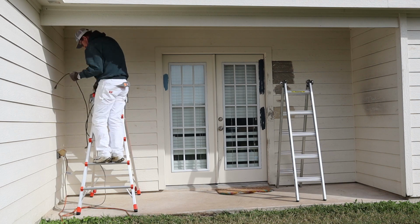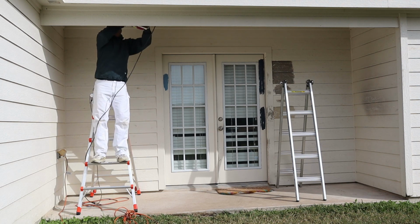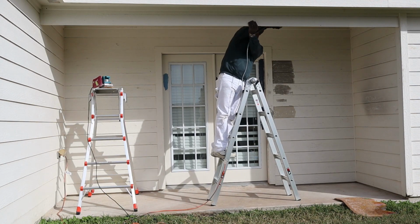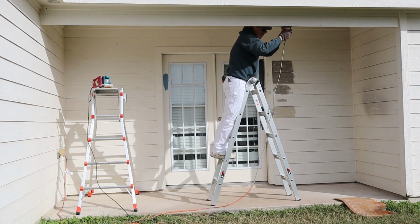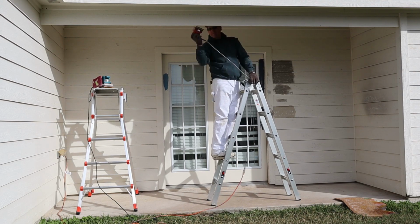But the other thing I noticed is after I would sand, there would be pockets where there's no paint. So when I primer, I'll make sure I primer well on the edges to get paint up in there. And then when I paint the color on, do the same so that I can block any water going up inside there and causing any rot.